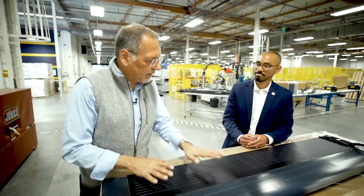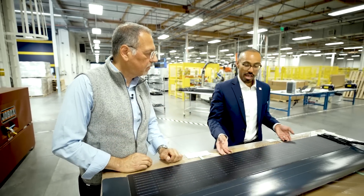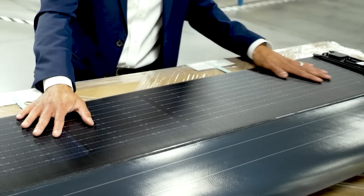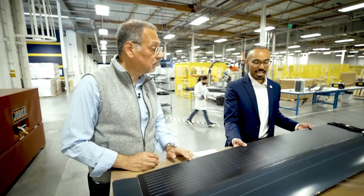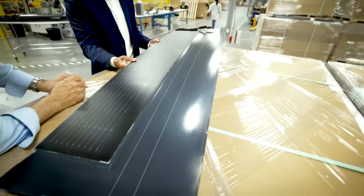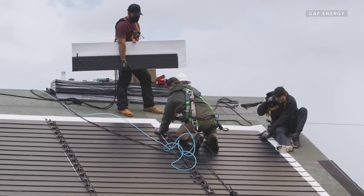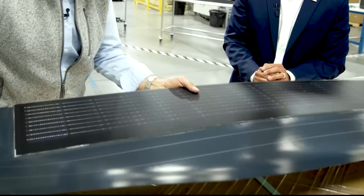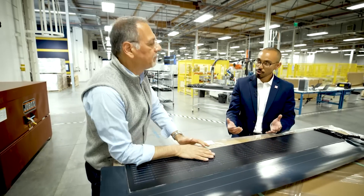Can you cover and get the same amount of power per square foot as a traditional rack mount system? So for this product, we're about 14.5 watts per square foot — that's the power density equivalent to your traditional bolt-on solar panel. However, the size and shape of this allows us to fit into a lot smaller areas than a traditional panel, which means on a given roof we can cover more square footage to get that customer more energy. You've got more divisible parts you can tuck in here and there and utilize the roof a little better.